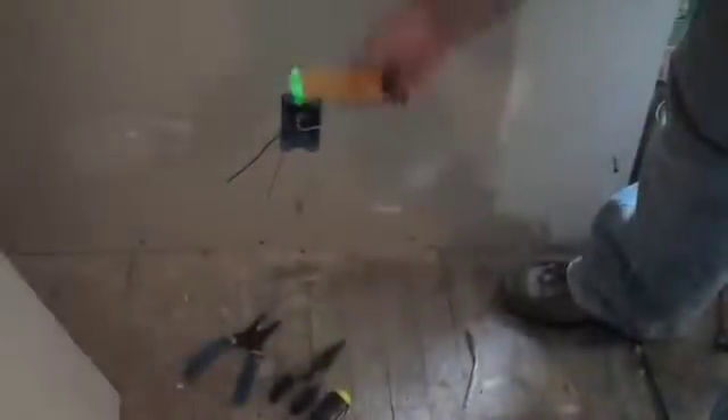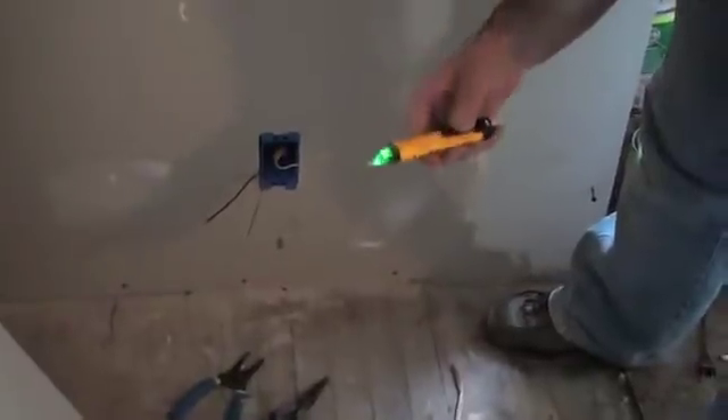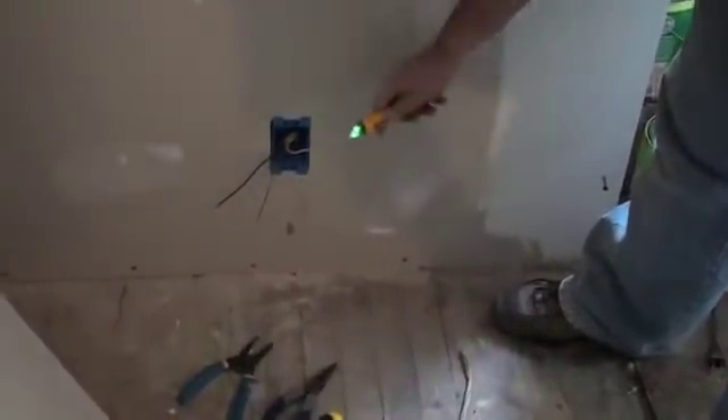This is brand new construction. Typically, if you had to change a broken outlet, you would rip it off and have three wires. The first thing to do is test whether we are live or off. This is a quick pen tester. Green means we're okay and can go ahead and work. But if it were live, that warns us that we're hot, so we want to hit the circuit breakers and turn it off before we get to work.